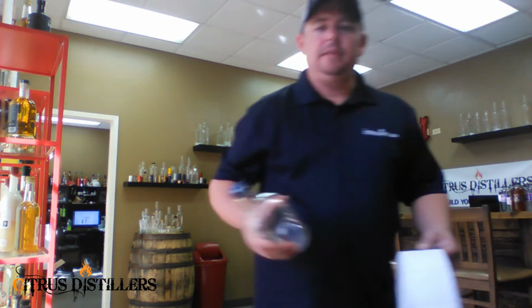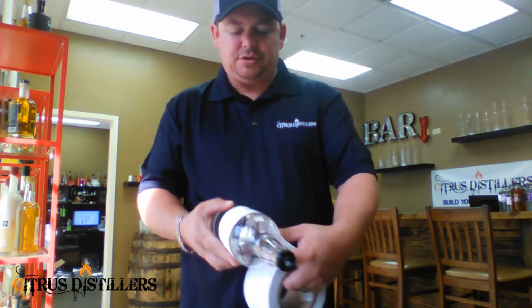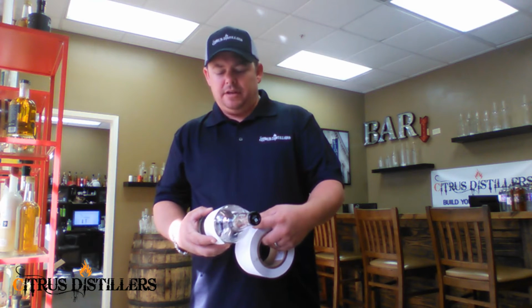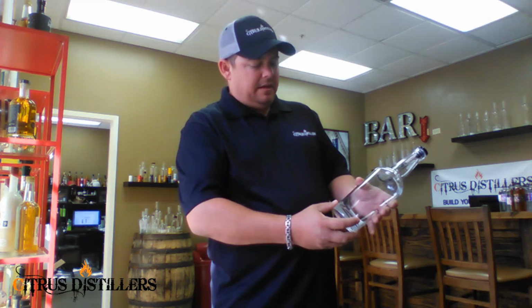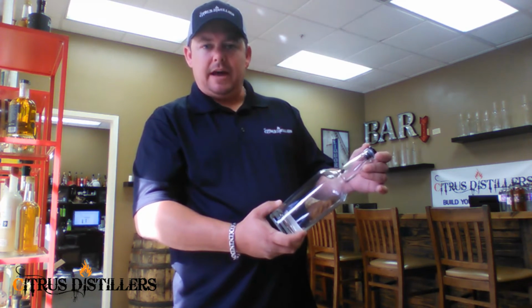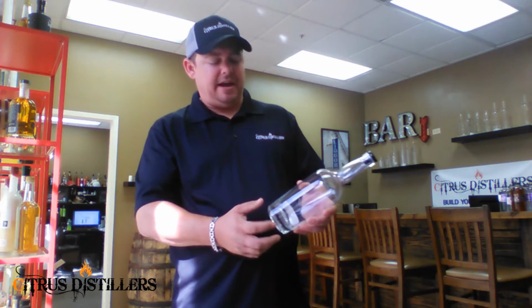Now the big one lately is the tapered bottle. When you're applying a label to this bottle, as you can see from the video, it looks like it's going on perfectly round, but there are actually spaces in there which are going to cause creases in the label. The whole idea when you do a tapered bottle is you need to have your printer do a die cut for the taperedness of the bottle, so that when the label gets applied, it goes on straight. If it's not tapered, the label will go on crooked and you're going to get creases in it. That's going to save a lot of headaches and money if you're buying labels, so make sure that your label setup is correct for the bottle you're trying to use. So remember, for a tapered bottle, you have to get the die cut in a tapered form so that when it's applied, it goes on correctly.